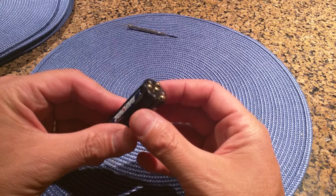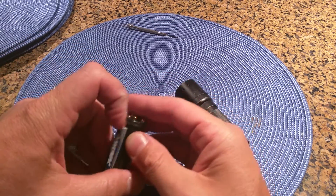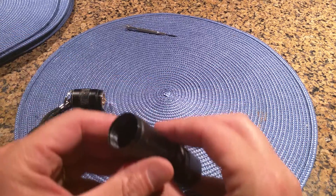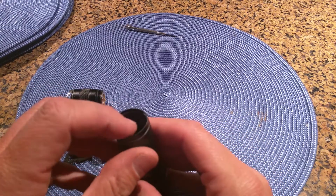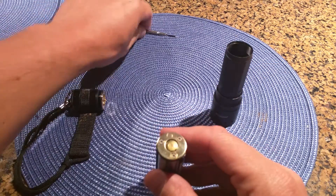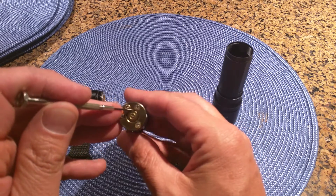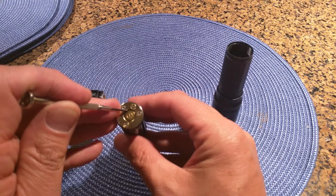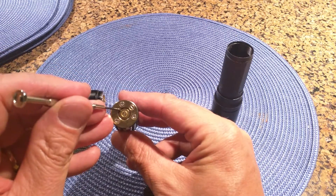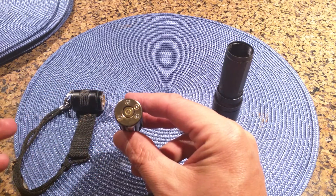It's got this little battery tray, and I looked for problems. There was a battery that had leaked, so there was some acid leakage and a little bit of residue inside the case. I cleaned that out, but it didn't help. The problem was that the acid, because it conducts electricity, had left enough of a residue in between the outside ring and the inside contact that it was allowing a little bit of voltage to leak across.